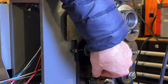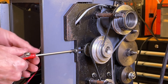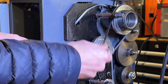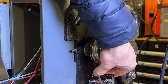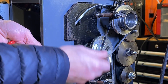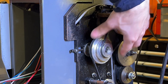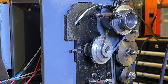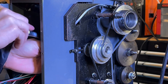That applies to both belts — you need to make sure you don't over-tighten them, because if you do the belts don't last very long at all. A little bit more... yeah, that's about right. Now go in the back and make sure you tighten the pulley back down, because if not you'll get a lot of vibration and you'll wonder why.